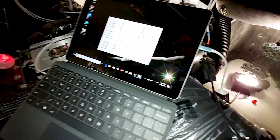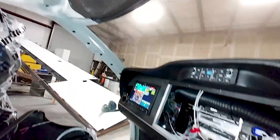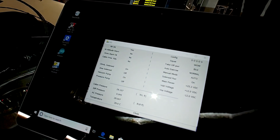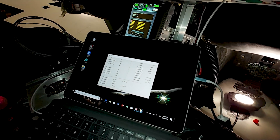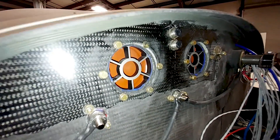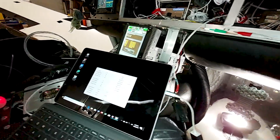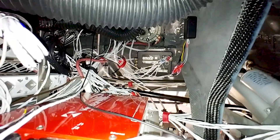There's that little RS232 cable I bought Friday evening — just hooking that up to the laptop gives you the connection. Turning off the dump valve puts it back into ground mode and the squat switch returns to WoW, with the valve just normally open and allowing air to flow. That's essentially how it all works. The outflow is what I've just shown; the inflow is what I showed before from the back end of the cabin, and that display is Bluetooth — so we have two independent systems.